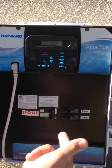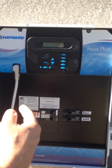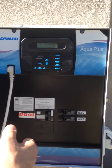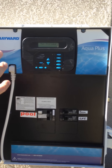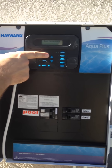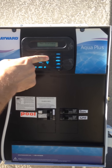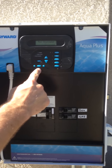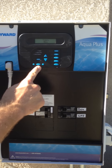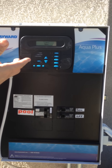So next March–April time frame, when the temperature is consistently over 80 degrees and you begin swimming in the pool, you're going to want to adjust it to 80%. To do so when it's at 60%, use the plus arrow to adjust the percentage up to 80%, and click Menu to set it. It goes back to the regular timers menu, and that's all there is to it.